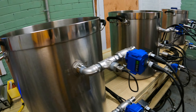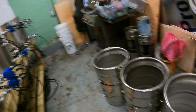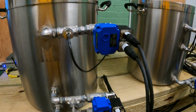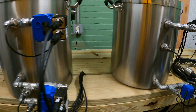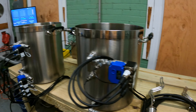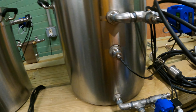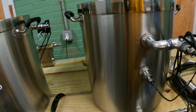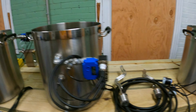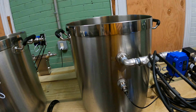What we did was I cut out all of the fittings and then I took them to a professional welding shop. I explained what we were doing and got their assurances that they could weld this to sanitary quality. All the welds looked really good on the outside, but when we got it back I started to notice corrosion issues on the inside. My advice would be: if you're going to go this route, skip welding. It seems like a great idea, but it's really not worth it.